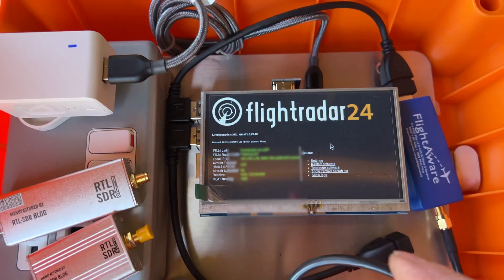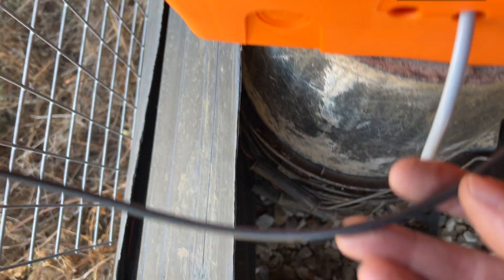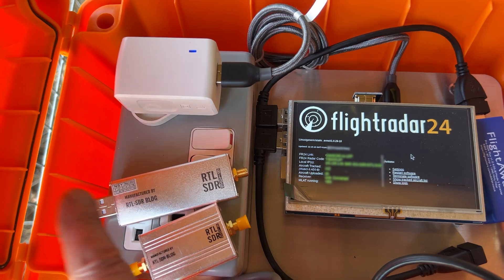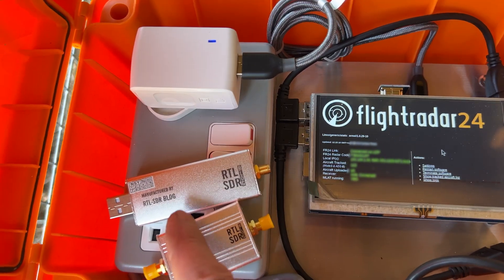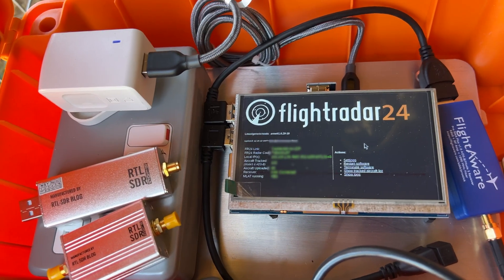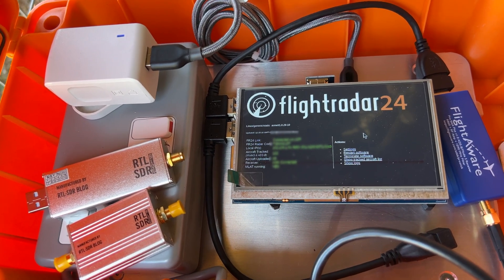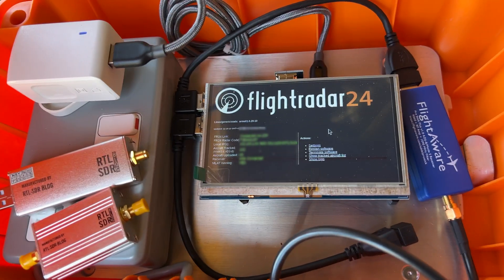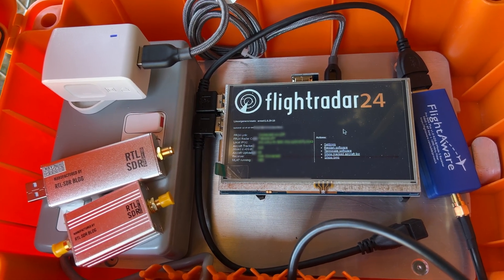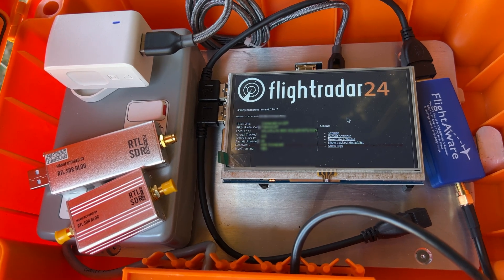The plan is to swap this stick back to the RTL-SDR one but with an active USB cable, so effectively the 10 meters of coax will go down to one meter maximum, fed straight into the dongle with an active USB cable running back to the Pi. An active cable is powered and quite happy to work at 10 meters due to the built-in electronics - normally a USB cable is only good for about five meters. I may run out a 20 meter active cable to the main radar receiver. I'll give more details in the second video, so keep a look out for part two - thanks for watching.